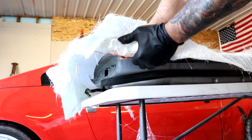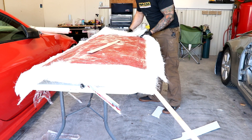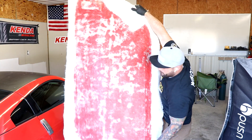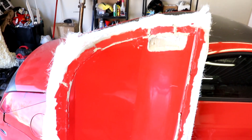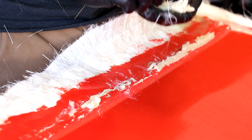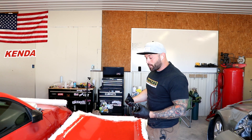We have our mold now. There are some minor imperfections, but a lot of it we can work out. I'm going to clean up the wax and show you guys what this will look like. You'll see that we can just basically lay on gel coat and then a couple layers of fiberglass, and should be able to pull just a mirror-finished product — a really nice looking product. So now, just like before, we're going to apply some PVA, let it dry, apply some wax, then put on our gel coat and a couple layers of fiberglass, and we will have a finished product. Not perfect because the door wasn't perfect — that's what happens when you don't take the time to do the body work before making the mold. Should be good enough though.